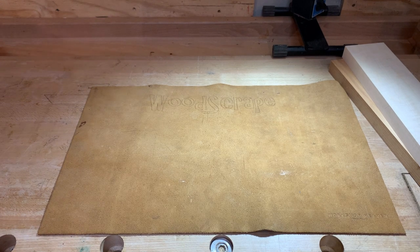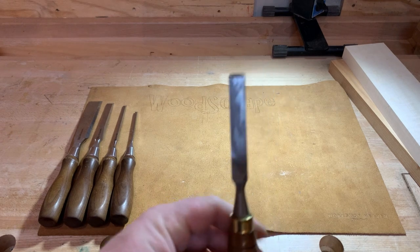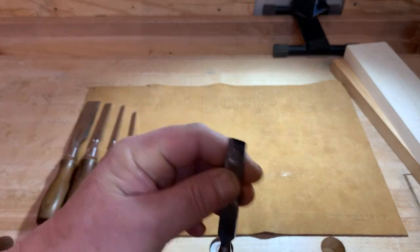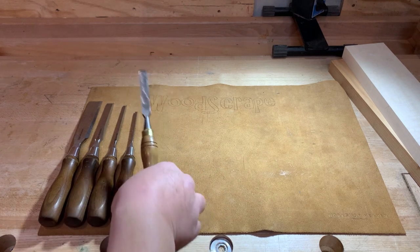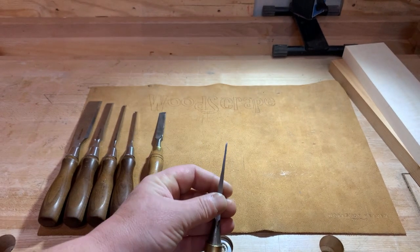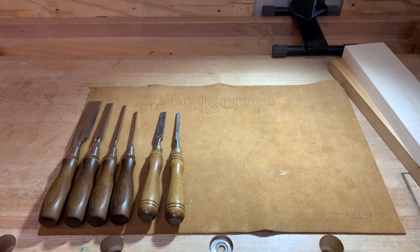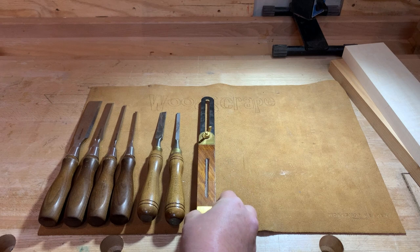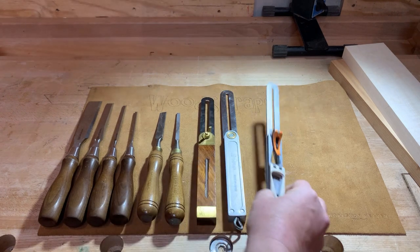There are a lot of tools involved in this. I'm starting off with chisels — utterly butchered, but I need the thin profile. This is where it got interesting: the number of sliding bevels you have determines the size of the joint you can make, as in how many actual tails. I've only got three bevels, which limits the number of lobes you can cut on the joint.